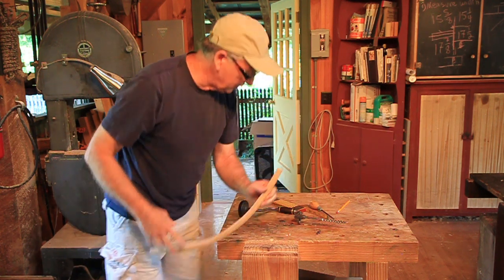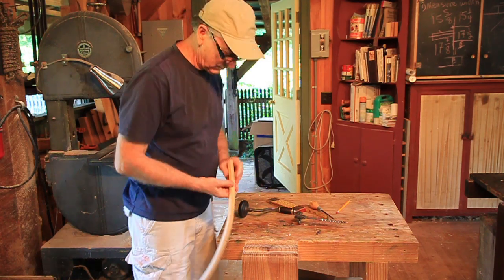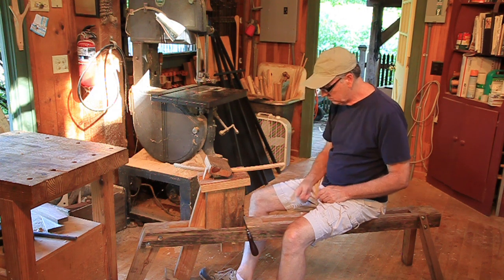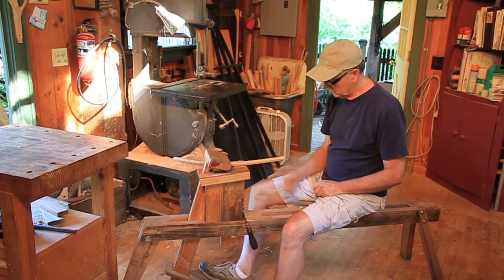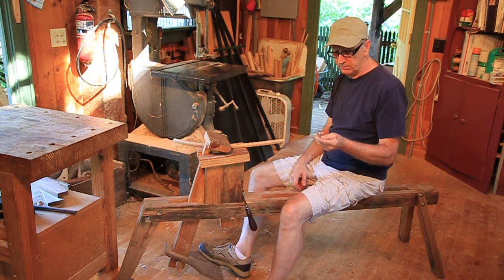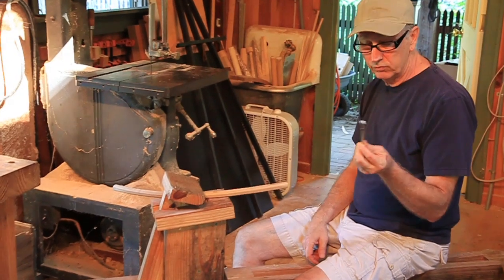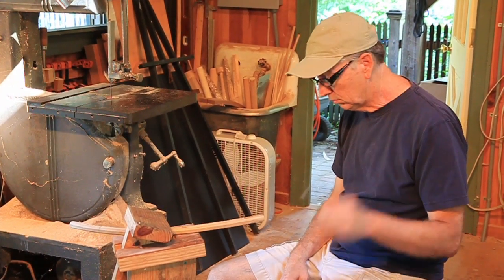Okay. So I'll do it to the other side, and then I'll bring the shaving horse in, and I'll see you in the shaving horse. So, now, there's a lot of ways to gauge this, just by eye. But another way that's cheap and inexpensive is just a wrench. So I'm wanting 3/8 here, so I'm going to go for a 7/16 wrench. Give me a little bit of leeway.